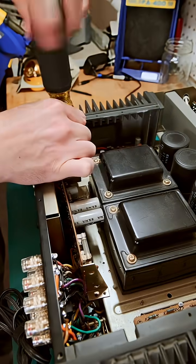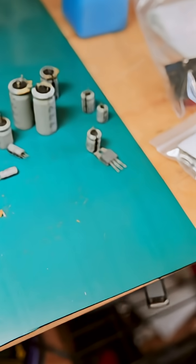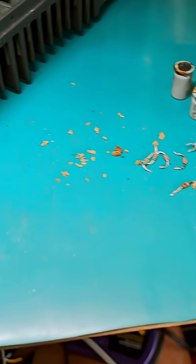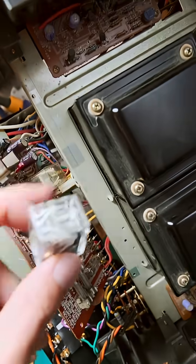I'm going to replace that next as we rebuild the power supply. I just replaced the capacitors, a regulator, and a few diodes, and removed all the corrosive glue that hangs out on this power supply. Last to replace is the relay.